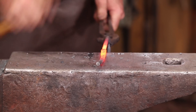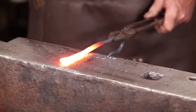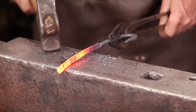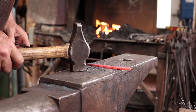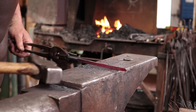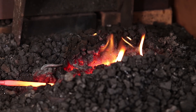I don't know if this really has to be flat — I just like the looks of it. Bring everything back to parallel as it bulges unevenly from the hammer blows, then knock the corners off a little bit. If you need to, you can hit it with a file, but this is a project that ideally you do 100% right here at the anvil. Now that one's ready to bend — let's go ahead and finish the other two. If you're working multiples of things like this in a coal fire, make sure you turn the blower off when you go to the anvil; otherwise you're liable to burn up the one you left behind.